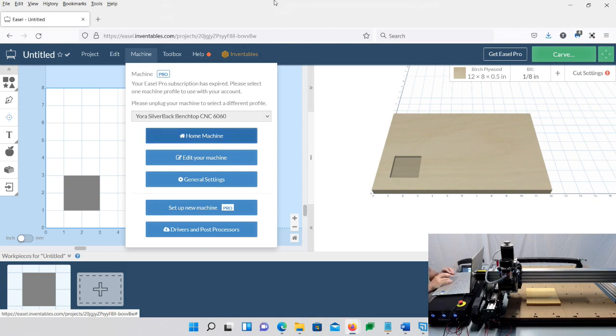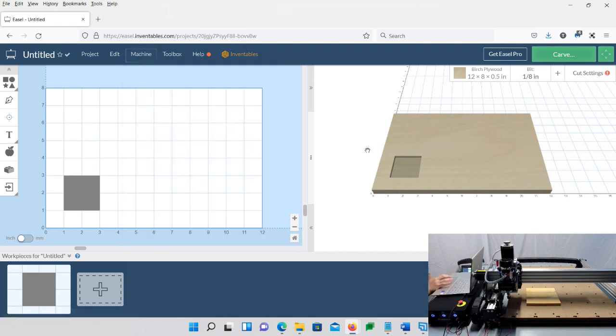So as you can see, you can play with the settings, but really super important, don't go faster than what I have here because you don't want it slamming into the walls and jamming the limit switches for sure. So just a word of warning, you don't want to go super fast like that. So okay, let's get out of that and let's go to the next step.